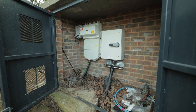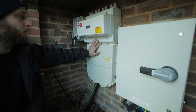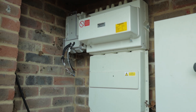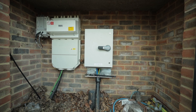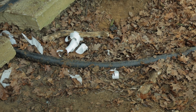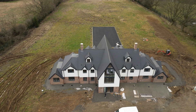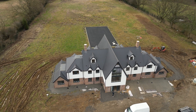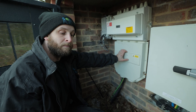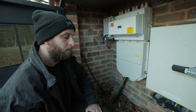So this is our kiosk. Power comes in from the pole over there — the DNO owns this section; this is UK Power Networks where we are. This is going to be the meter, and what we've done is put in this big fused isolator. We've got 150mm five-core cable that's going to take the power from here over to our little mains electrical cupboard over there. This is just because it's a large property — we've actually got a 200-amp incoming supply to feed it, because there's quite a lot going on as we'll see later.